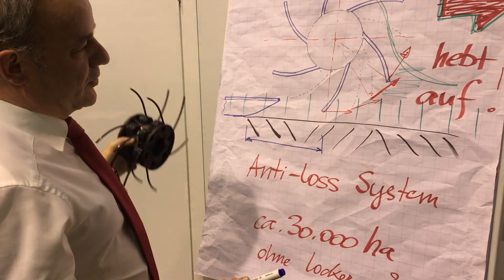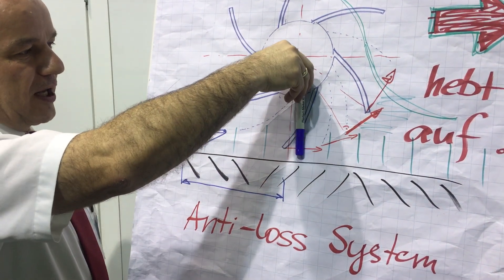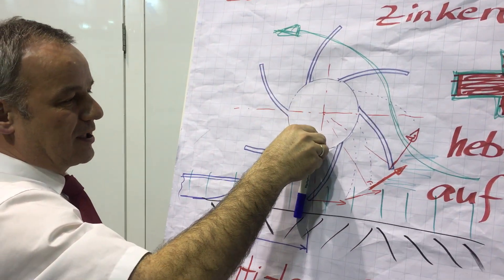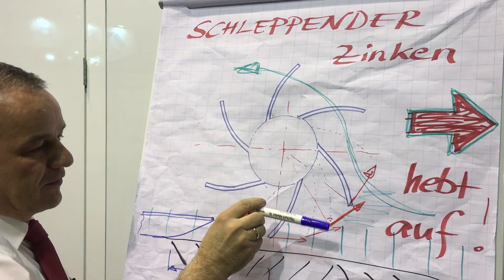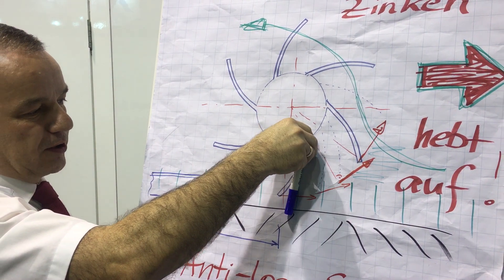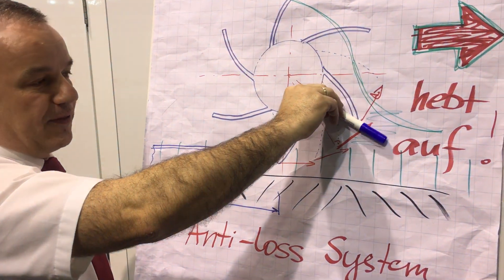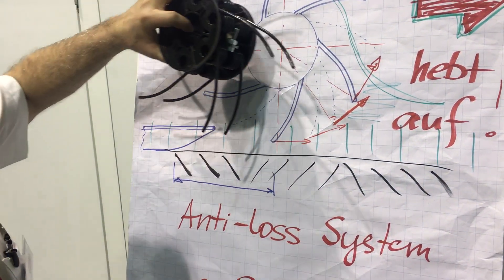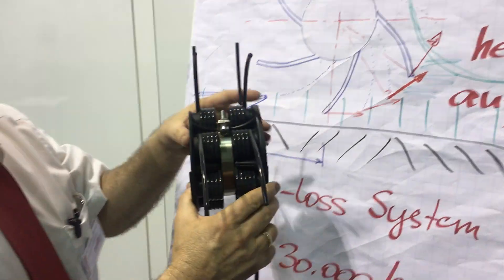The competition is mainly using large diameter pickups. The tine is more or less vertical and works upward to lift the crop and bring it onto the belt. With our system, which is a lot smaller in diameter, we don't have to go this wide way — we are lifting very fast upwards. With their rigid pickup systems, when they touch the ground it will aggressively point into the ground and kick the stones. This causes a lot of stress for the tines of big diameter pickups. With our small pickup, as I already said, we slide over it — it's very gentle and gives us excellent lifetime.